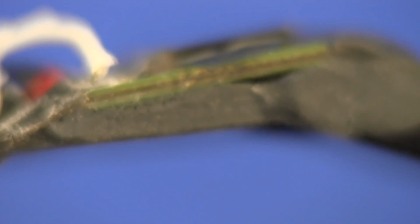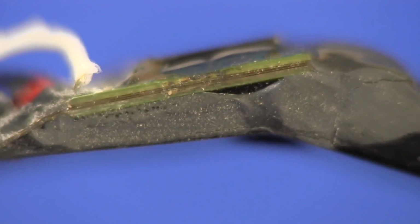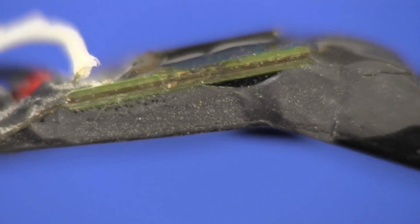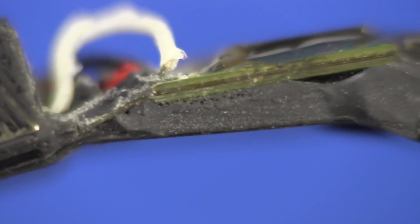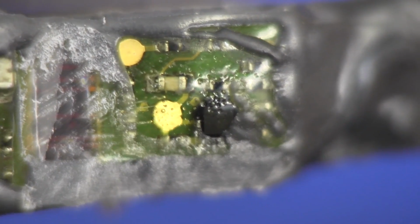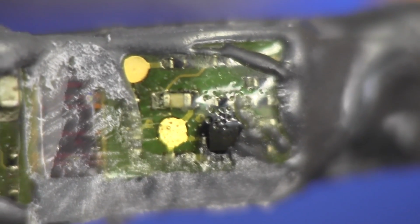I've done this before on seismic products, where circuit boards have to be wrapped around a central core in the middle, like a central wire bundle, and the PCBs have to wrap all around that. And you do that, join the boards together using a sandwich flex technique. And they've got some more circuitry on another board in there, and that looks like it's got a conformal coating on top of that as well, and then it's surrounded by the rubber.